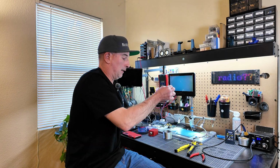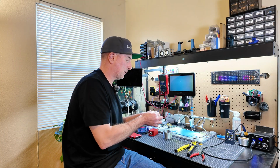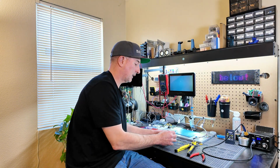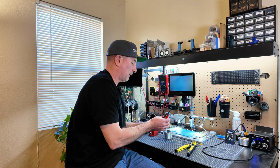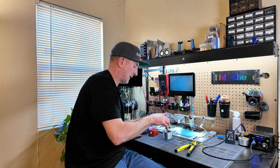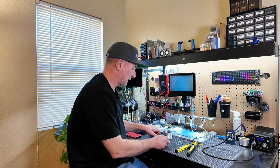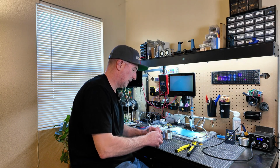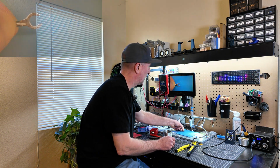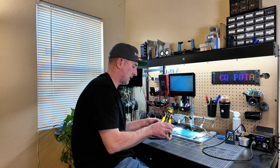Okay, so I have about, I would say, an 8-inch piece of wire that I stripped. The first thing I'm going to do is add on my spade connector. And since I'm going to solder mine, this stuff's just going to melt, so I'm going to go ahead and take this plastic coating off of this. Okay, now I've removed the plastic coating so I don't melt it when I solder it. I'm going to go ahead and stick this wire through here. And then I'm making sure that I have enough wire sticking out for me to solder. I'm going to go ahead and crimp this.